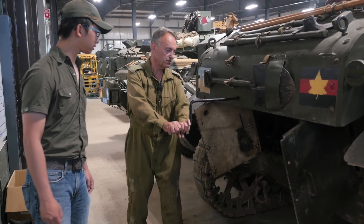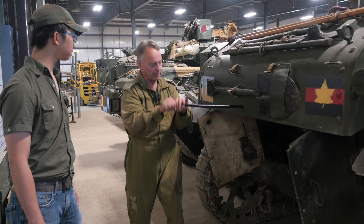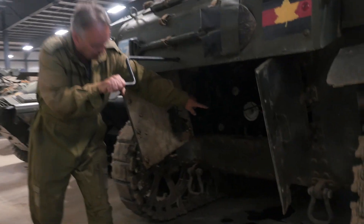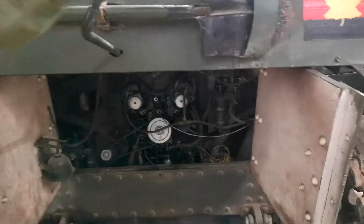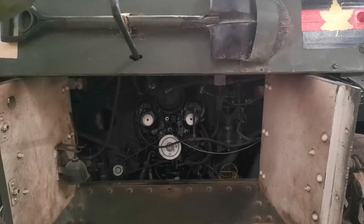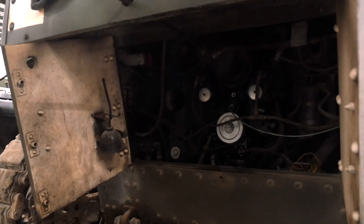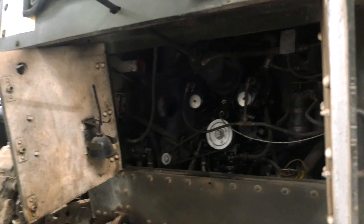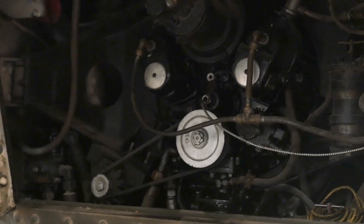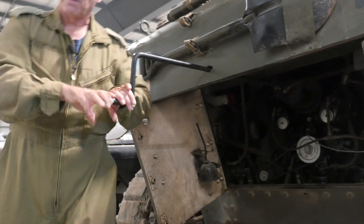So we're going to start going clockwise. And as I turn, it gets stiff — that means one cylinder is coming to the end of the cylinder head. So you've got to really lean into it. And you watch the numbers on this little pulley down here. When they get a full revolution, you've got one revolution of the engine. I like to count because it's more precise. All this is doing right now is getting the bottom three cylinders' oil out of the cylinder head, because it does leak — it's just the tolerances on these engines because it's an aircraft engine. Not as tight as the engines today. I've already done this previously, so I've got it in a tough spot and I'm going to let you go ahead and try.